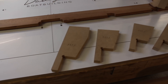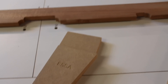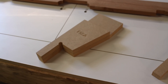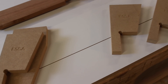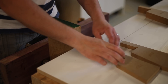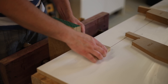The only other thing left to do is the support legs. The frame supports consist of two parts - frame support aft and frame support forward - and they simply fit together like so to support the frame in the correct position off the strong back when assembling the whole boat. They can be fixed together with any glue and screws, pins, however you want to do it. These are designed to fit on the strong back - that inner corner is what references it. The easiest way to align them nicely is to put a block in a vice and sit the support against it.